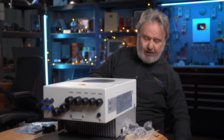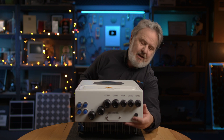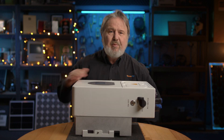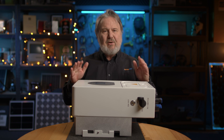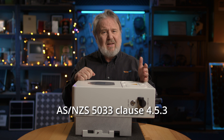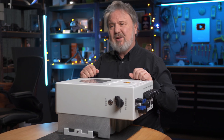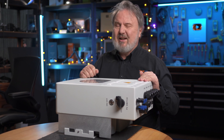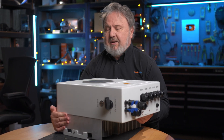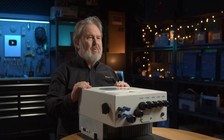Let's have a closer look at this unit. On the side here, we've got a DC isolator and it's lockable. That's a big deal in Australia because we're required to have isolation adjacent to an inverter system. If you don't have a lockable isolator integrated into the product, you've got to put an external lockable isolator, which is a bit annoying. The unit here has two MPPTs, which is great. And for a five kilowatt inverter, that's just the sweet spot you want.